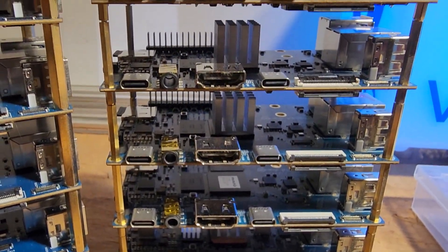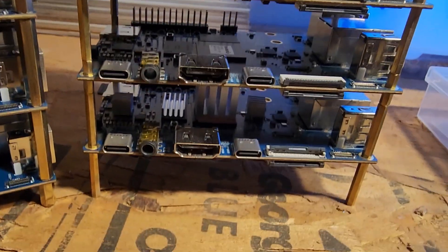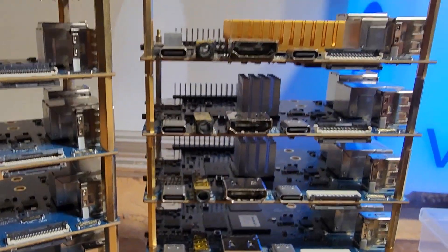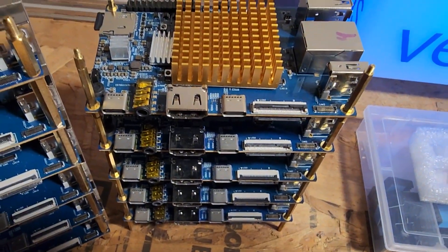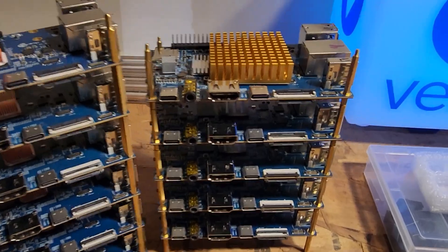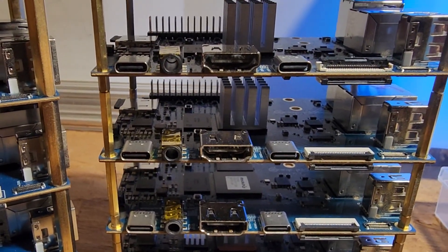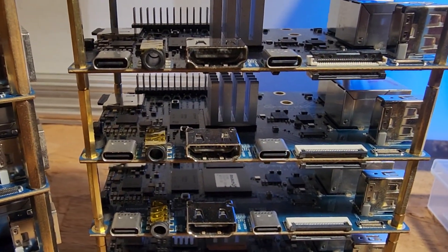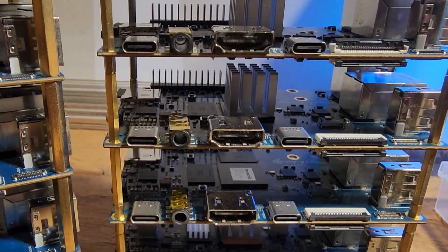Back to the tower test - the aluminum ones were not really acceptable in a forced air case at around 78C, and temperature also depends where you are in the box and the airflow. We'll have to test some box designs. In a crunch, the large aluminum block with a large surface area actually works the best if you can't get the copper ones - stick it on with a thermal pad but you need forced air. The tall ones are turned backwards on purpose to simulate a medium case scenario.